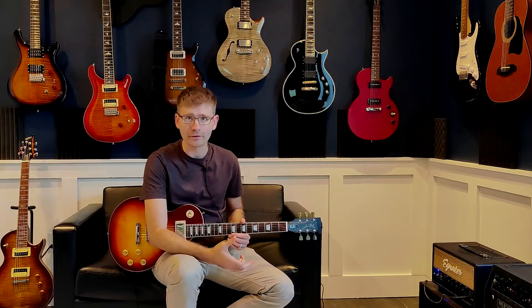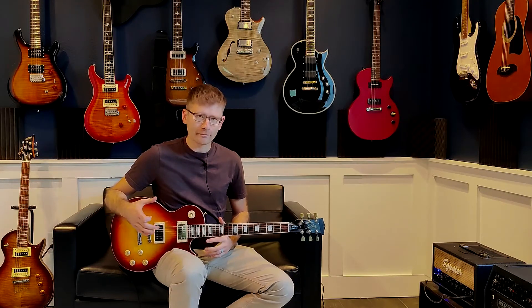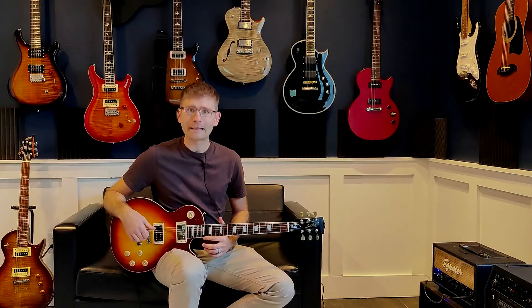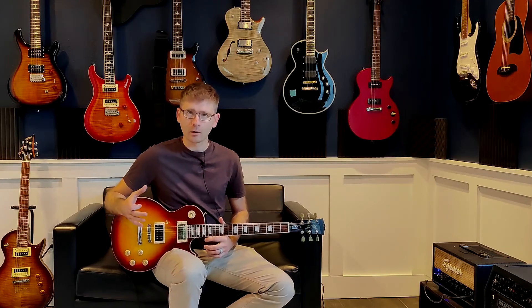Hey everybody. In this video we're going to be taking a look at the capacitance of your guitar cables and the effect that that has on what you perceive to be the resonant frequency of the pickups. Capacitance is the ability to store an electric charge, put very simply. The resonant peak of your pickups is basically the frequency that your pickups are going to have the highest output at. This is a really good way to judge the characteristics of a guitar pickup. Since I have dived into the pickup making business, I have been looking very heavily into what things change the resonant frequency of a pickup, so I can tune how I want that pickup to sound.